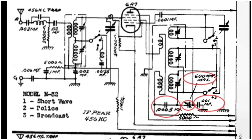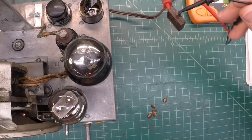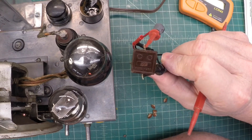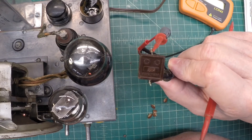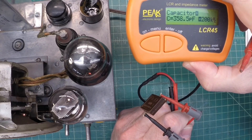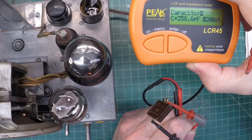This is a keeper radio for myself, so if I have additional issues I'll get in there and swap out the others. I hope you found that helpful. It just shows what you can do by using just a little bit of coolant spray and doing some troubleshooting. I probably should have done a wholesale replacement of these caps as well. The lesson learned: never assume that all mica capacitors are actually good. You can see this is way out of spec — right now I'm at 358.4 picofarads when I should be at 1000, so way, way out of tolerance.